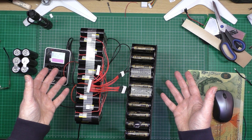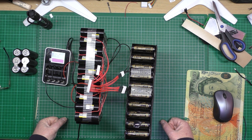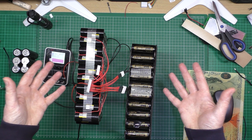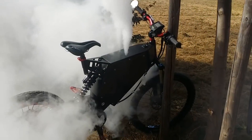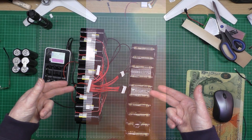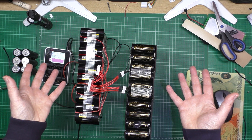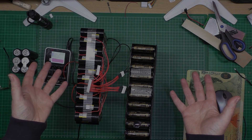On the balance leads, every cell has a positive and negative, so you can take two adjacent leads and follow them — one goes to the negative of one cell and the positive of the next. So those two wires give you the positive and negative of that parallel bank. You can just tap into those or use an Arduino header and jam the pins into the wires. Someone close to me has raised concerns about the danger of building batteries, but if you know what you're doing and keep things at storage voltage, they are 100% safe — as long as you don't overcharge, over-current, or push them to the absolute max. Tesla cars rarely burst into flames now unless they crash.